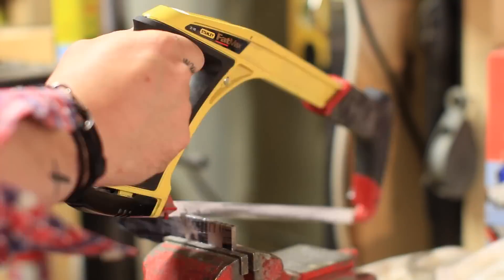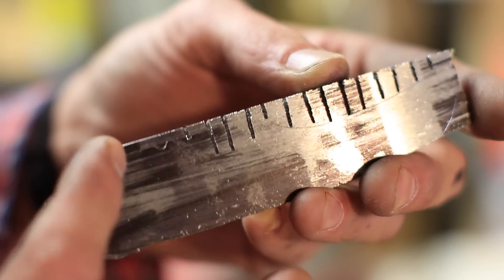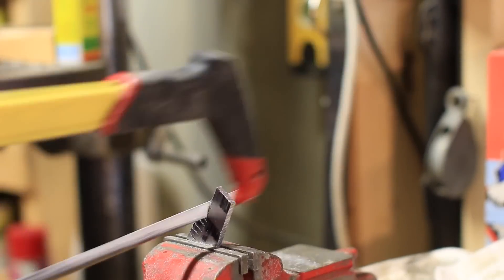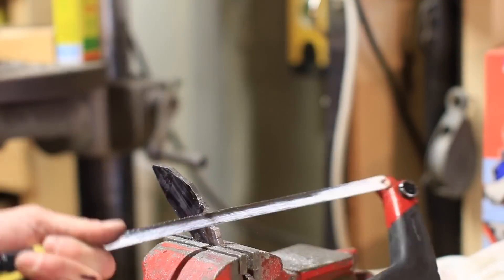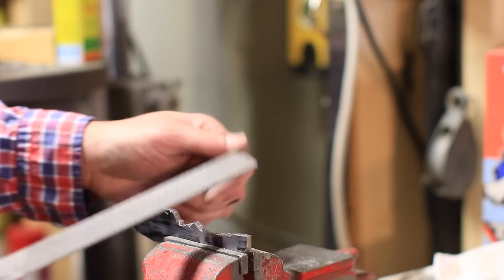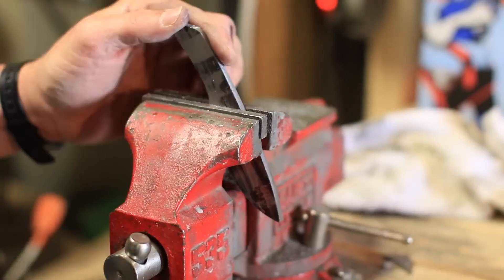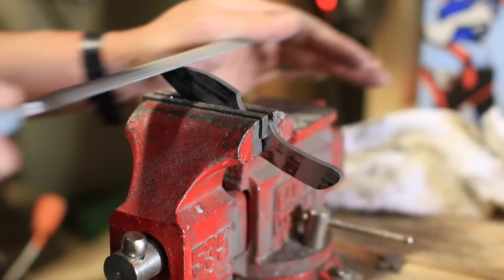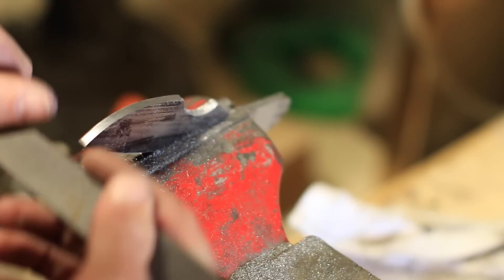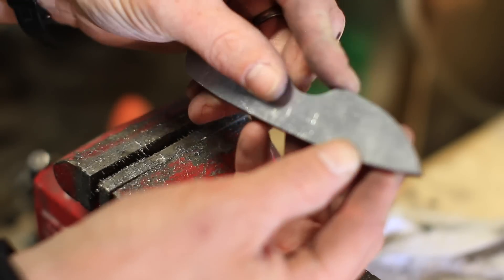Here we're cutting a series of lines down into the profile of the handle — that creates little sections that are easier to cut out one at a time rather than getting through everything at once. We follow the scribe line on the steel, and with those little lines it's much easier to get a rough blank. It's incredibly rough but the knife is starting to take shape. After that we smooth all those cut marks with a half-round file, flat files — lots of different files give you lots of options. Then we put a nice clean finish on the part that's going to be the edge of the blade.